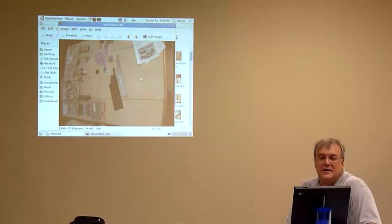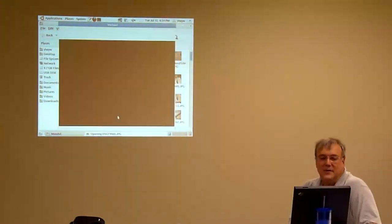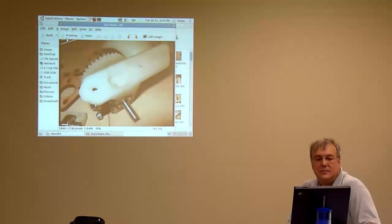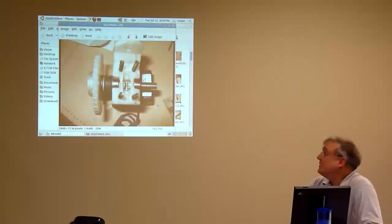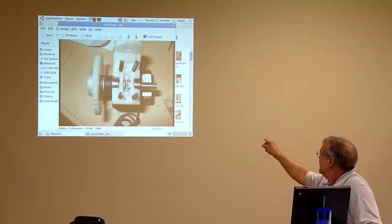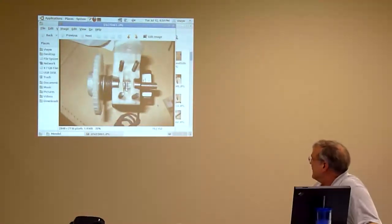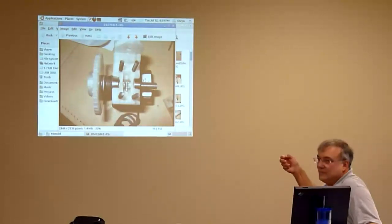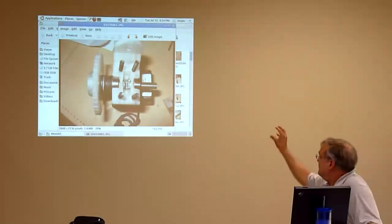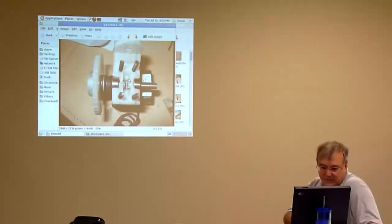So it was just a lot of parts and a lot of things to figure out, with few instructions. I made a few modifications of my own. Now, this is the feed mechanism. Looking at it in this orientation, filament comes in the bottom and goes out toward the top. That bolt is what they call a hob bolt, a series of almost thread-like grooves ground into the side of the bolt that grip the filament and push it in. And all of these bolts sticking out the front have a piece of plastic with another bearing on it that holds pressure against that bolt to keep pressure on the filament.